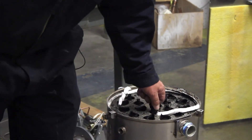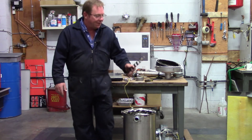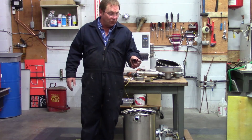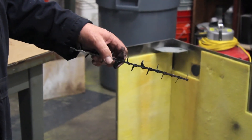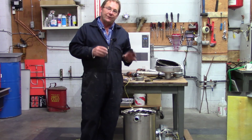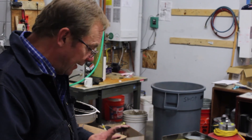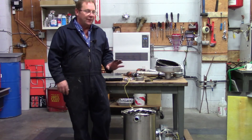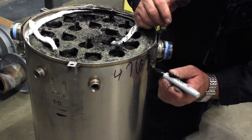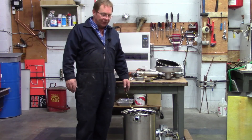These are the baffles right here, and look at the amount of material that's come off the baffles. My new heat exchanger is going to come with new baffles, so I can always pull these old baffles and clean them up — and I have some backup baffles. It is a warranty item. This piece of equipment is six years old, so 50% of the cost of the heat exchanger is going to be paid by Toyotomi and Rural Energies. I need to hang on to this heat exchanger until I get paid for it, because the factory might want it back. I'll write my warranty claim number in Sharpie on the front edge, put the date on there, and set it back on my shelf. When I get paid for it, I can dispose of it at that time.